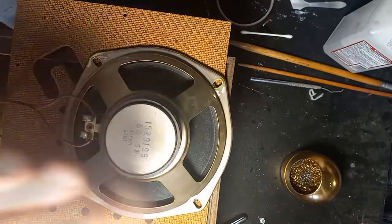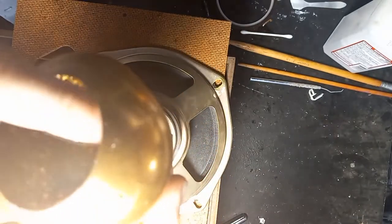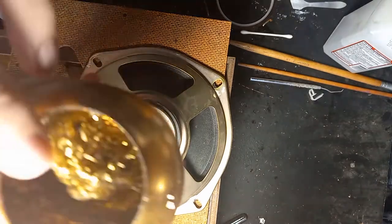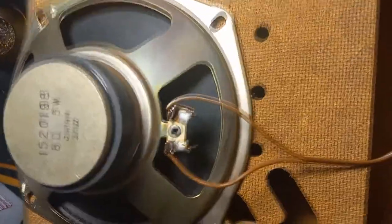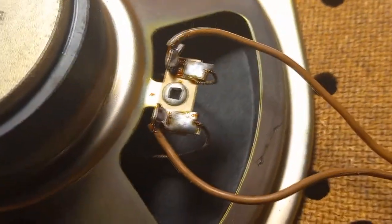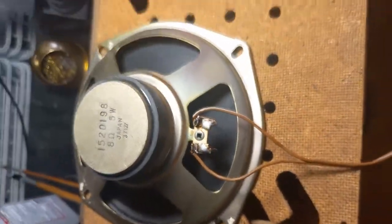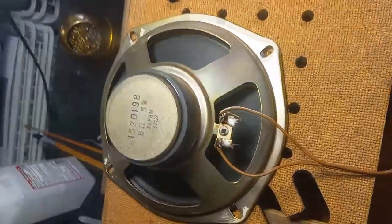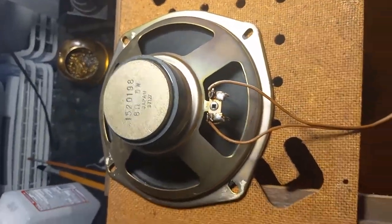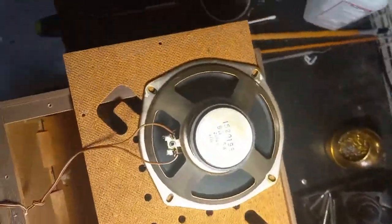When putting your iron back, be sure to add just a little bit of solder on it and tin the tip. Get one of these brass tip cleaners — they're fantastic. It's not a sponge you wet down; it's just brass and it comes with the housing. You can get these on Amazon. These connections look a little bit better now. If you're worried about the orange brownish smear you see, I've always known that to be rosin or maybe the flux that's in the solder.